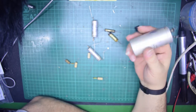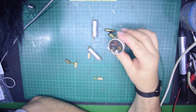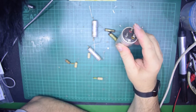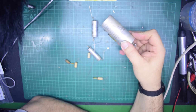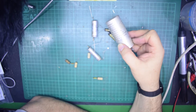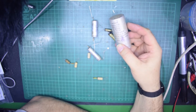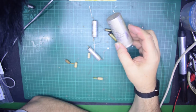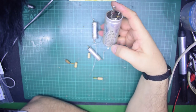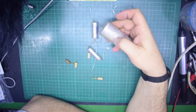That was the main electrolytic — it's got a little bit of fur there but it's not as bad as it looks. I haven't done a leakage test on it yet so I wouldn't like to say it's perfect. There's no date code on it. I've replaced it with the same capacitance value but a higher voltage rating, simply because these days you can mainly only get 450 or 500 volt capacitors — these ones were 8 microfarads at 350V DC, and commonly now you'll get 450V.